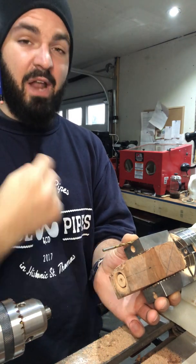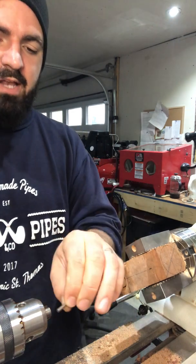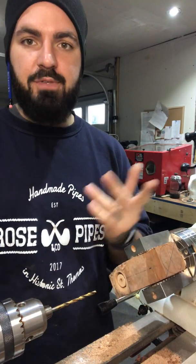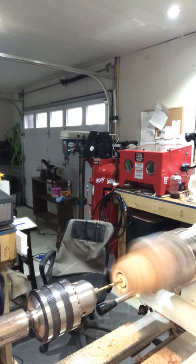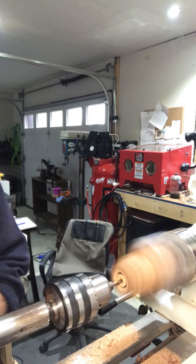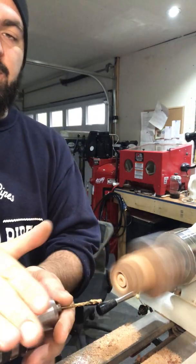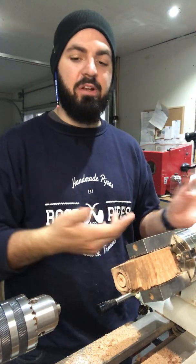That it's right there. And then what I do, other guys use tape, I just grab it right where it is, and I stick it in my drilling tool, lock it in, and then I will drill to that point on the drill bit, and I know it's right there or a little bit further, but again, your chamber's going to come down and catch it anyway. So the draft hole is drilled. You're not going to know if you're perfect in depth and length and everything until we do the chamber, because then you're going to make sure there's air running through it.